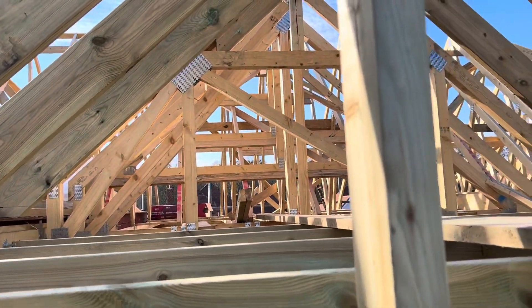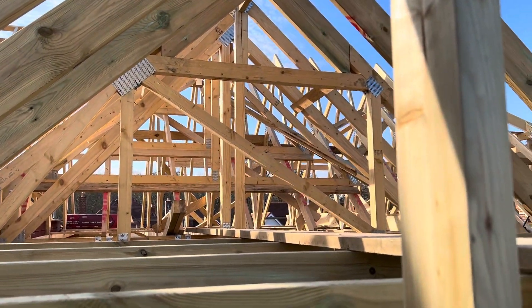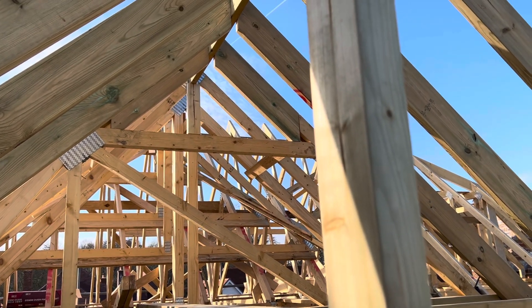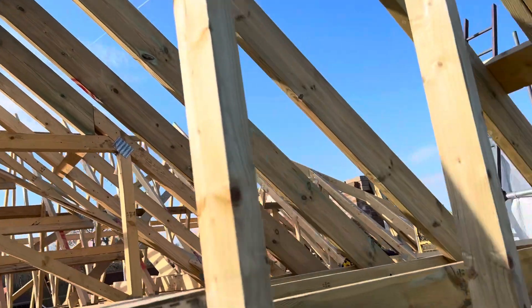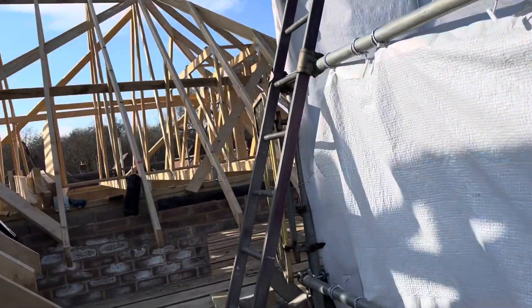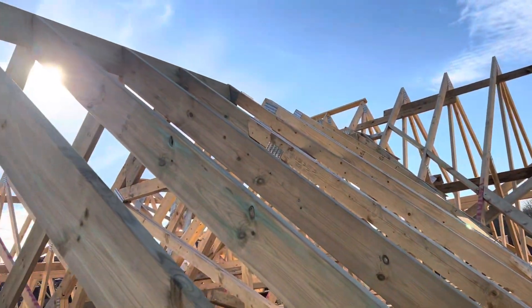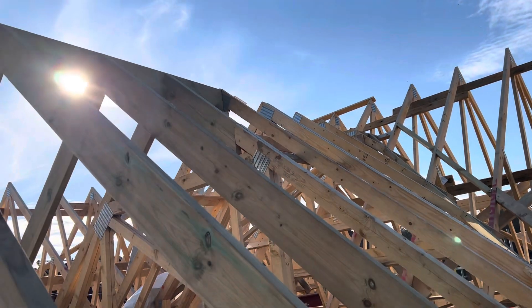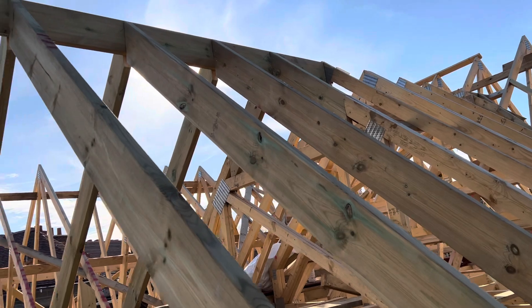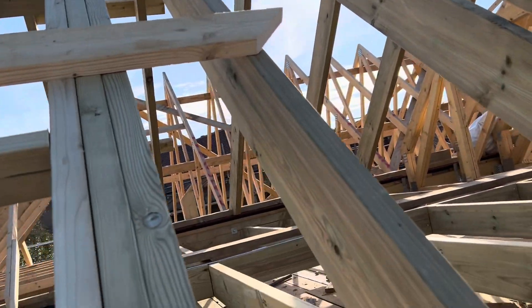This was our hip roof, so you can see the truss is still in there. We got rid of the hips and just put a ridge in off the last truss there. Then we pieced the little rafters in and just cut this as a gable.